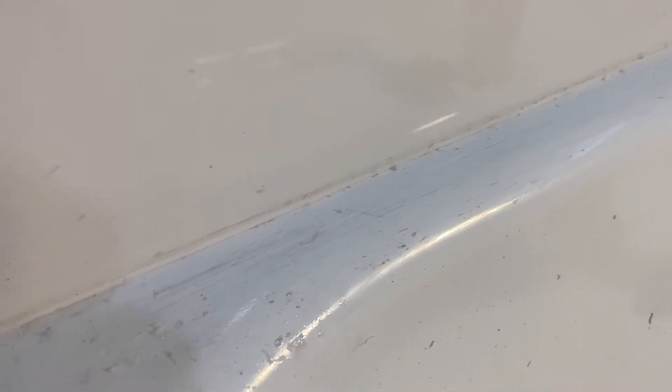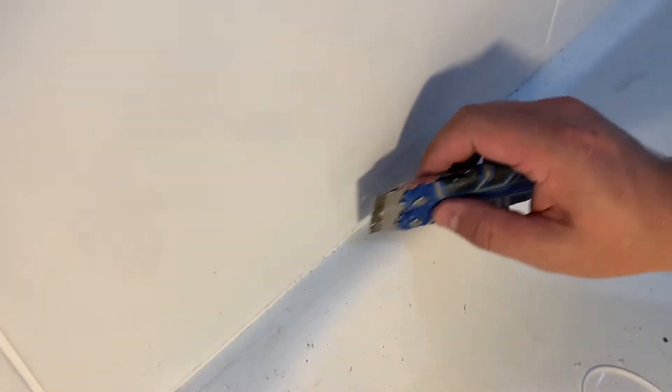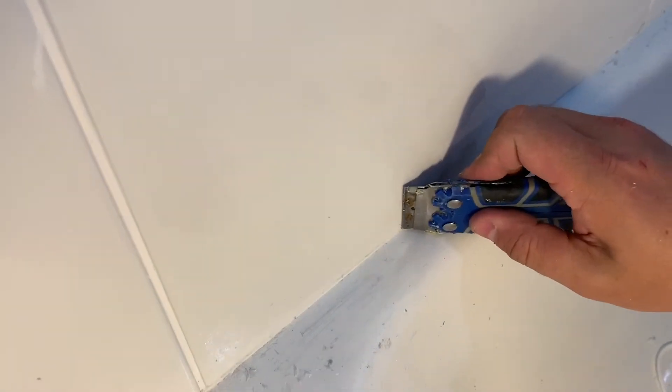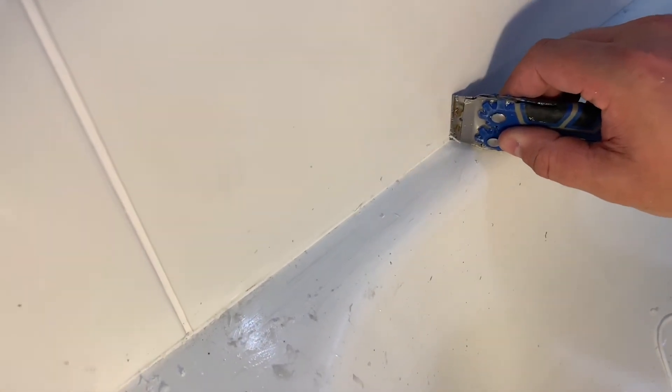So here we've removed the silicone off the bath. There's a little bit on the wall. Now we can do our job and it could look good, but if you want a really nice finished trim we're going to need to remove the silicone off the wall as well, so that when our coating fills that gap it will look like a perfect seal. That trims it off nicely, leaving nothing behind. We definitely don't want to dig the silicone out from between the wall and the bath, because then you'll get rubbish coming out through the gap and can spoil the job — like ants and cockroaches and whatever else is behind the wall.